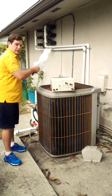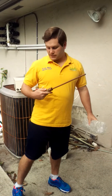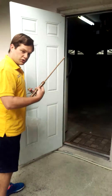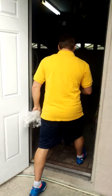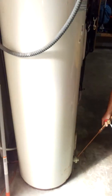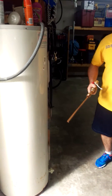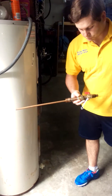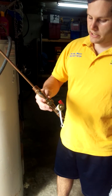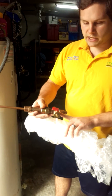To make installation easy on your hot water heater, this unit comes as a kit. It comes with this hot water heater tank drain adapter. You would simply take the drain off of your old hot water heater and empty out the tank after you've turned off your city water that goes to your tank. Then you would replace it with this multi-function drain adapter, which allows water to flow both ways, and it also comes with a new drain on it.